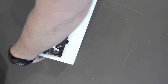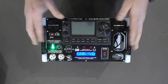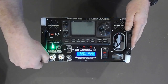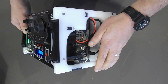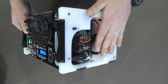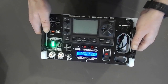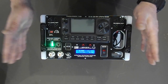Like a lot of our gear, the chassis or the structure of the machine is primarily high density polyethylene — half inch thick slabs basically that we CNC machine. It allows us to build it almost like people build furniture, with mortise and tenon joints and rabbets and radiuses and counterbores. It's a great material to work with and it's extremely durable.